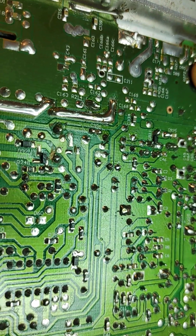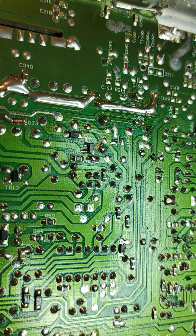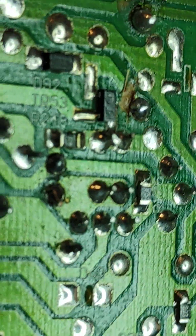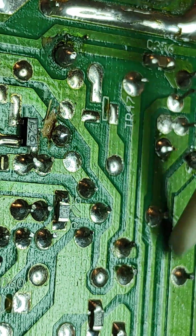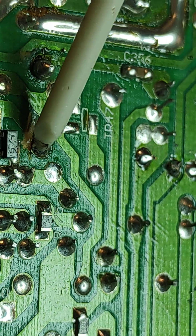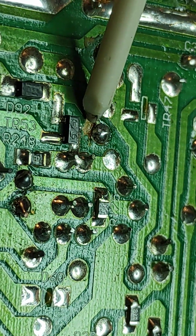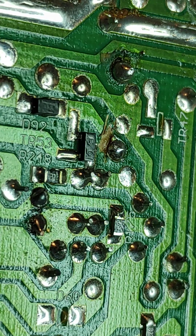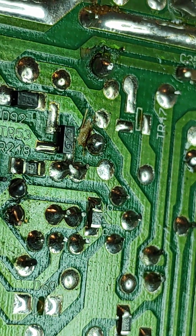This genius way of disabling the limiter circuit in a radio — I believe this is the first one I've ever seen. Right here and right here is where the resistor solders in — this is one leg of it, this is the other leg. As I was desoldering to put the new one in, I just happened to notice right here some ding-a-ling had cut a big chunk out of the trace going from this lead on to the rest of the radio, the rest of the circuit.